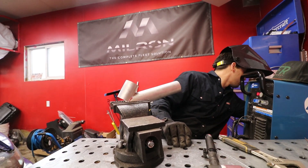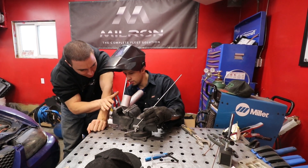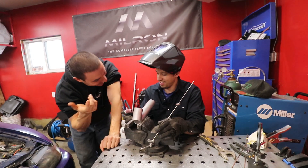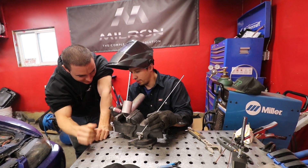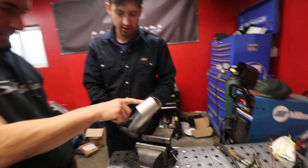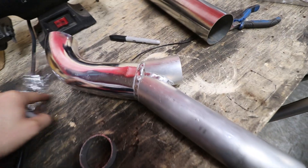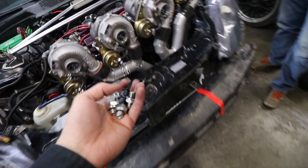I need more rod. That's all the aluminum I have left — uh oh. When we use the MIG welder we do silicon bronze, right? We joined two pieces of pipe — this is good, man. Only one miss here, don't touch it though, that's where I ended it. We did merge this up — this has to cool down now. That's two two-inch pipes into a two-and-a-half inch pipe. I had to crush it a little bit. We did get lucky — we managed to find some of these fittings locally, so they fit our oil feeds.